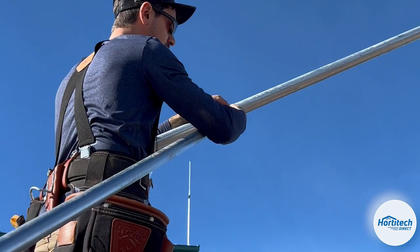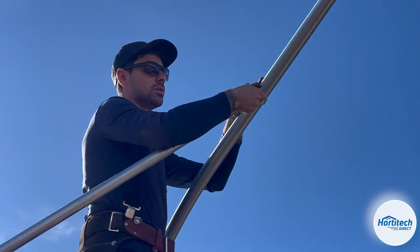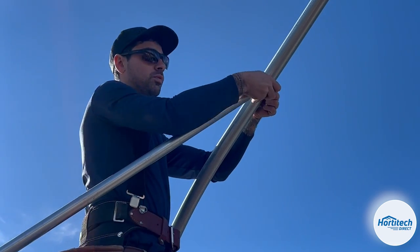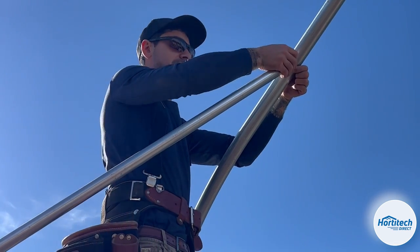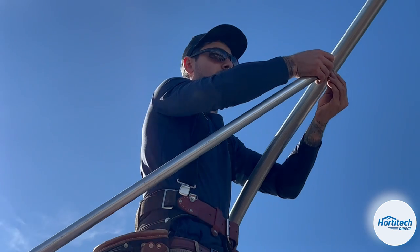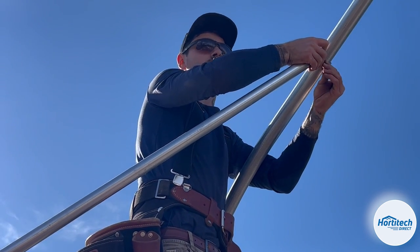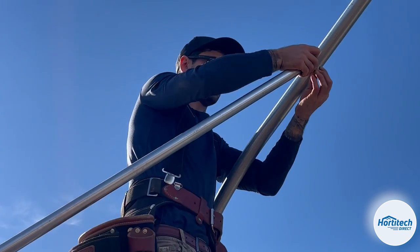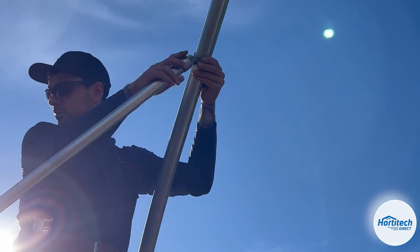And I realize that I put the bolt in backwards, because we do not want the bolt thread pointing towards the plastic. If wind were to pick up, wind could be slapping and pushing the plastic down and hitting that bolt, cause a small hole to occur and potentially rip the whole thing off the greenhouse. Boom. So.